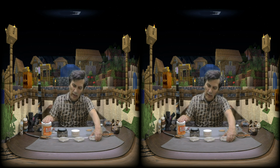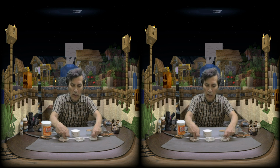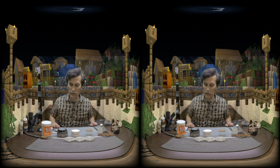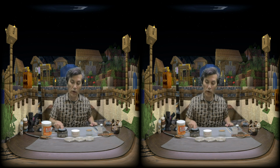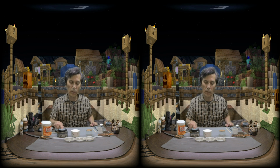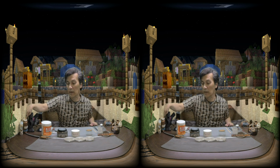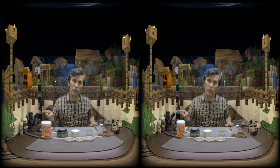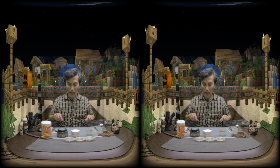What this does is it shrinks as it cures. So now that these graphite particles are coated, as the curing process continues, they're going to go closer and closer together, thereby lowering your resistance. So the trick with this paint is that you need to allow it to cure for at least 24 hours. This will be nearly as effective as this copper acrylic paint, but you won't have the hassle of needing a brush or an airbrush, and it's a tricky paint because it likes to break, but that's for a different episode. Anyway, so we're just going to make some simple paint.